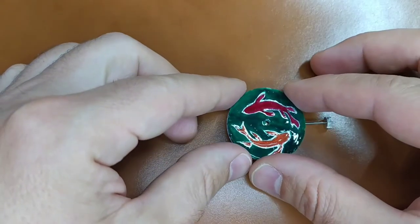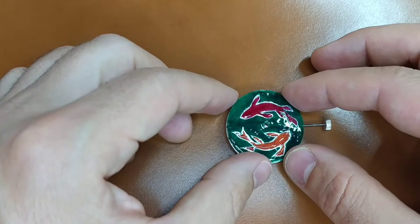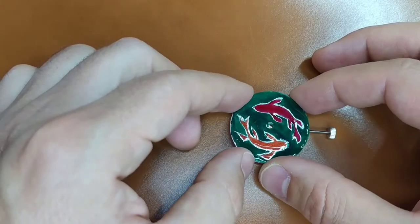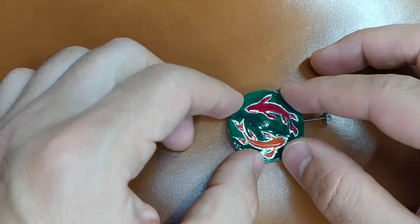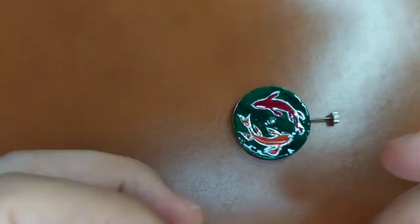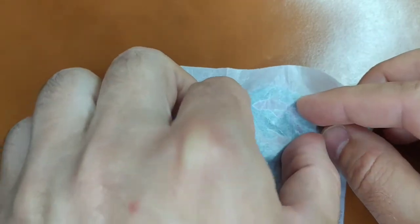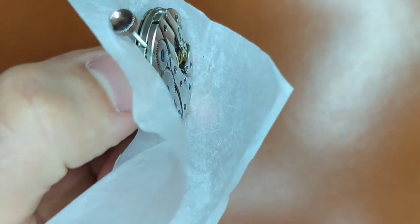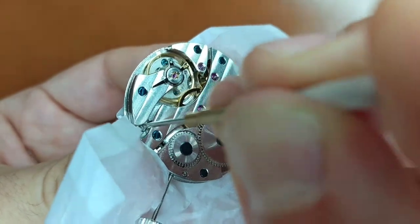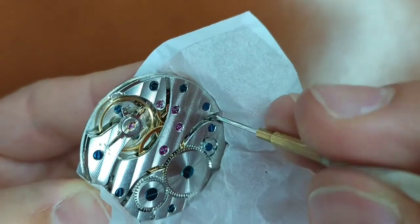Before painting the dial, I made some cuts as hour markers, but it still took me some time to align the dial properly. The 3 o'clock position of the dial must be aligned with the crown. The feet of the dial go smoothly into their corresponding holes, while I press the dial firmly to the watch movement. I don't use gloves because in reality I don't touch the dial with my fingers — I put the paper inside which the dial had arrived. When the dial is firmly pressed against the movement, I turn the two screws that tighten the dial fit. The dial will stay in its place permanently.